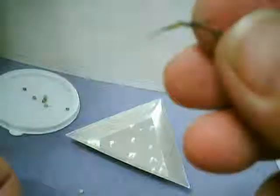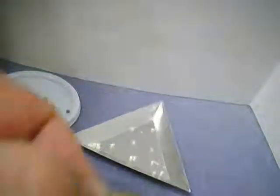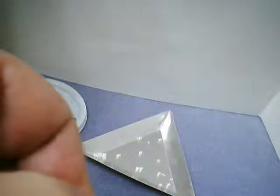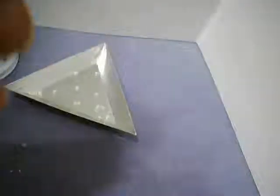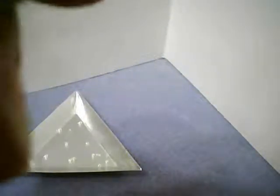I'll push the twisted wires to the back of the channel. You can see this is the original — you can see how they were twisted together. So I've used the same technique, because I assumed that the maker at the time knew what they were doing. Then I'm going to very carefully push this down so it's bent further down into the channel, and very carefully squeeze the channel closed over this. You can see how I've now closed it fairly well over that wire. It's a little high and straight up, so I'm going to try to close it a little better and make it more of a curve.